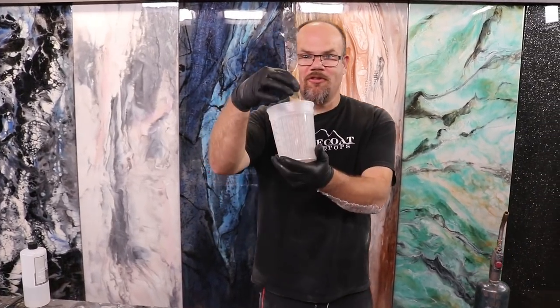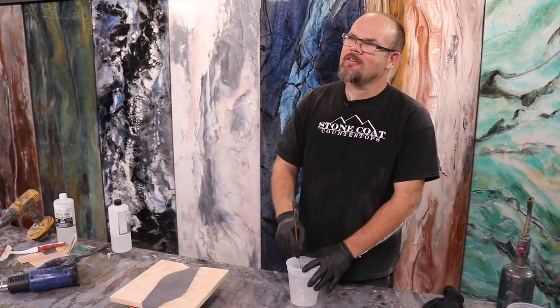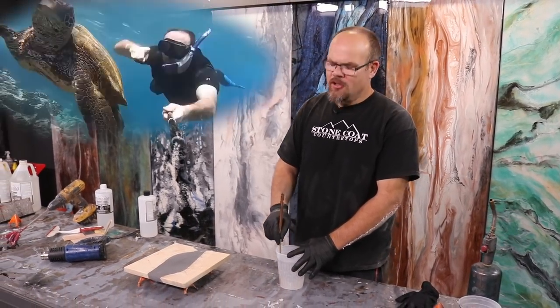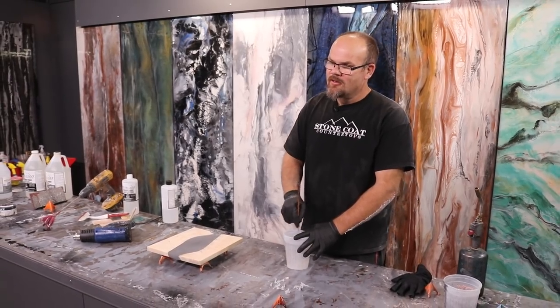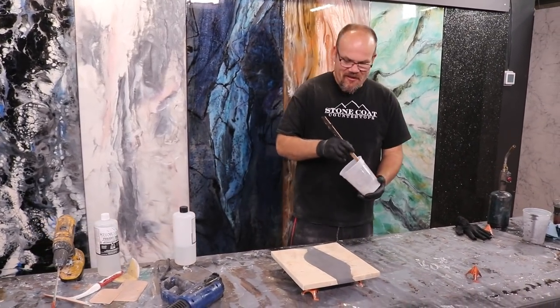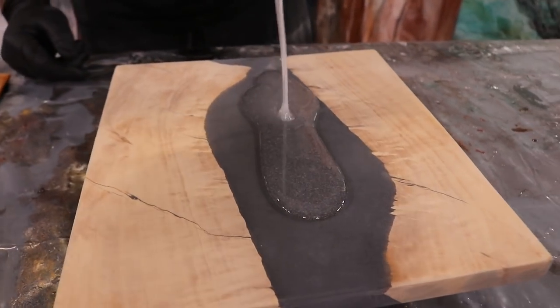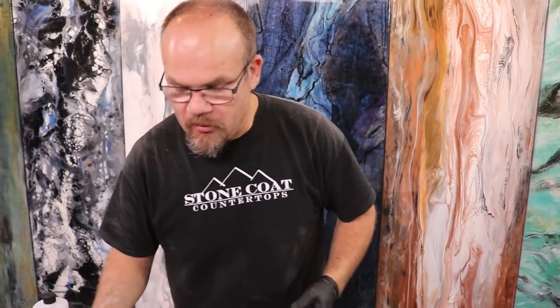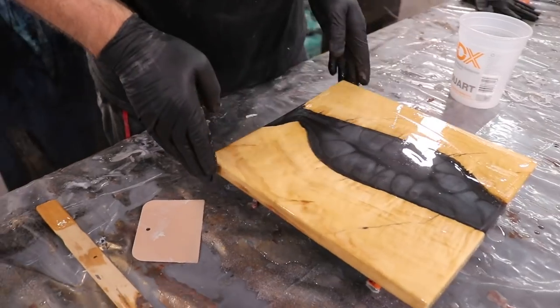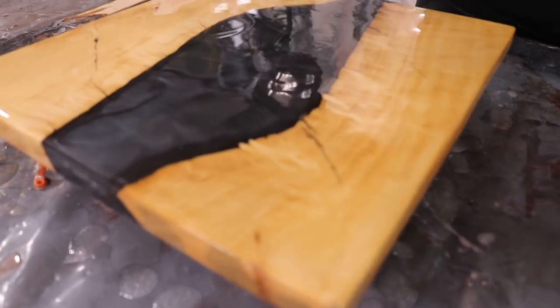Question of the day: how do you clean your paint stick? You don't — you just flip it over. You know what I love about mixing epoxy? You get to think about other things — your life goals, what's coming up in your day. You could even write a book in your head while mixing epoxy. I really think black and tan was the way to go on this box elder — it's really light and that black looks really sharp. I can't wait to get it wet again with this epoxy. I'm going to use my gloved hands to apply the seal coat to the edges. I could use a torch or heat gun to remove the air — the torch will work faster, but let's test the heat gun. It brought that box elder back to life.